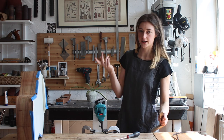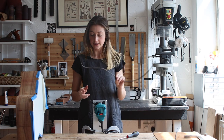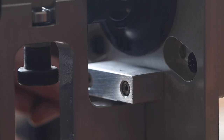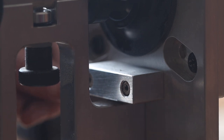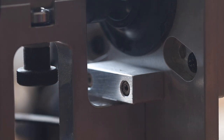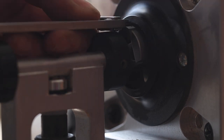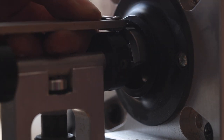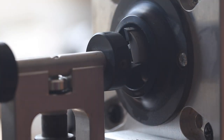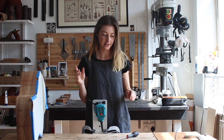Dreamy. I'm just going to check that calibration once more, just check it hasn't moved when I screwed it — and now it's looking really good. So now we can take our binding and use it as a real-time thickness gauge for the cut we're about to make. All you need to do is wind down the same knob that you used when setting point zero, to the thickness of your materials. Lock it off and that's as easy as it gets. When you're doing this with purfling, just add the purfling and the binding together and same deal — that's your purfling completely set. For the depth, I've used some calipers set to the depth of my binding or purfling, and just used the ends of the calipers to make sure the router is protruding the right amount. Really, really simple — don't overcomplicate it. And that is literally all you have to do to get this jig ready to cut your binding channel.